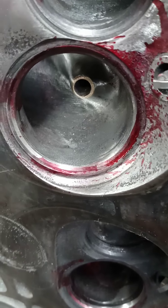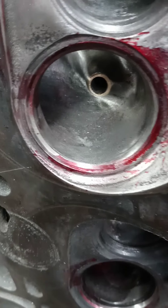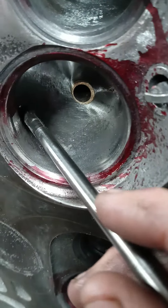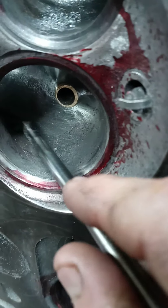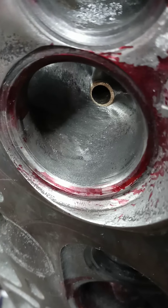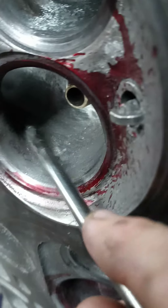And that bowl — look how clean that bowl is. That fuel is staying all on the floor. I did redo the floor; before it was coming up on the bowl in here, and you guys can see it's not doing that anymore. It's staying basically on the floor because I lowered the floor down and took that arch — that sweep — out of it.